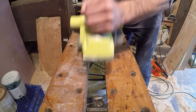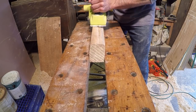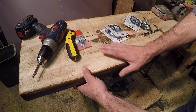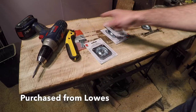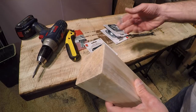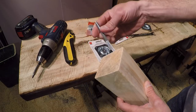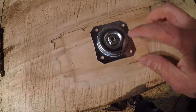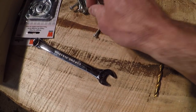Using the hand planer and belt sander, I was able to square up the four legs and round the edges. With the coffee table bottom facing up, I'm going to mount these leg brackets equally spaced, then screw in these 5/16 hanger bolts into the four legs. Using the belt sander, I sanded a flat spot to mount the brackets, and I'm also going to use longer screws than those that came with the package.